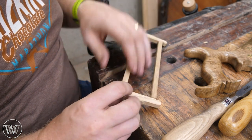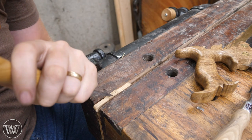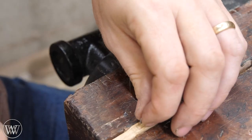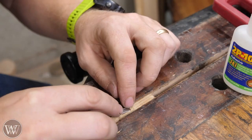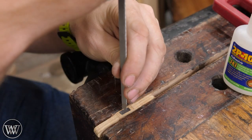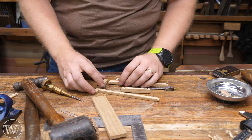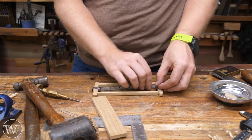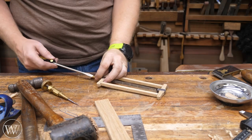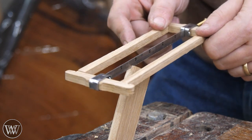But this is wood by right — I'm not going to stop there. We need a lot more detail: easing of the corners and some carving. Before that, I need to create a stop plate that goes in the end where the tensioning bolt is — it's a plate the bolt pushes against so it doesn't wear into the wood. I got it in there, added a little CA glue, and locked it in. It was actually left over from the ruler I cut to make the blade. Putting this all together was a bit of a chore — I had to put the pins in with the saw first, then assemble the frame around it. But yes, we can resaw lumber with this, and I cut down a good bit with oak.